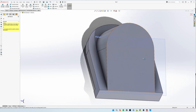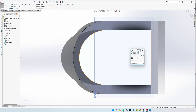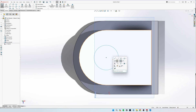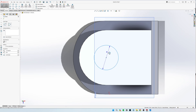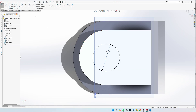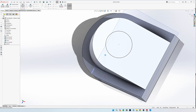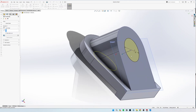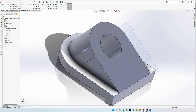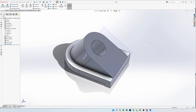Lastly, we need to draw this circle for the cut. Hover over the arc until the center point shows up, click the point, and now you can draw a circle concentric to it automatically. Grab the dimension tool — it is 1.5 inches diameter. Then go to Extrude Cut; it should automatically select it, then come up here to Through All. And that is it for the bevel washer. Comment below with any questions.